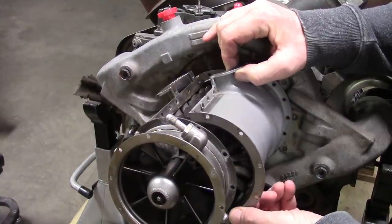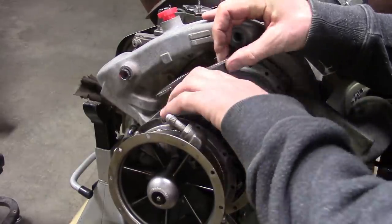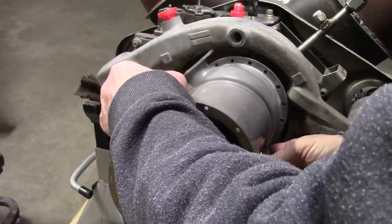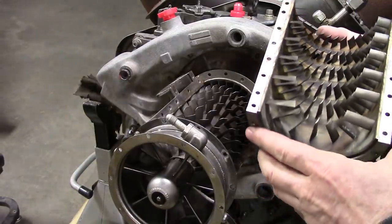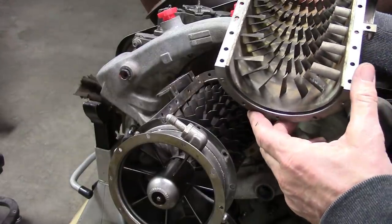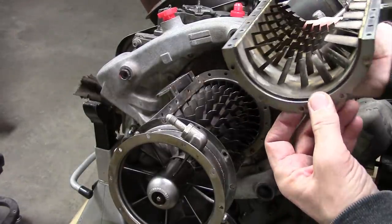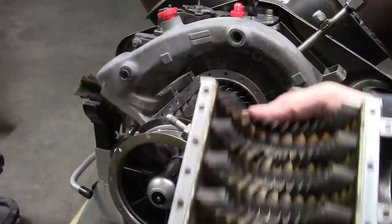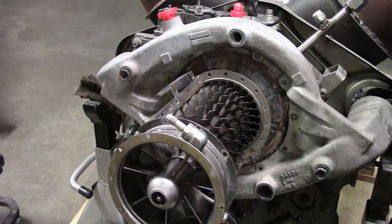I'm guessing we're going to find some deposits and some dirt. There we go — there we go! The stator case looks good, there are no rubs. This is a resin-filled component — we'll clean that up, but there's no scrapey-scrapies, no rubbies. Very nice — no damage to the stators. You can see that — that's beautiful, isn't it? Okay, so we're going to move in here and look at the rotor.